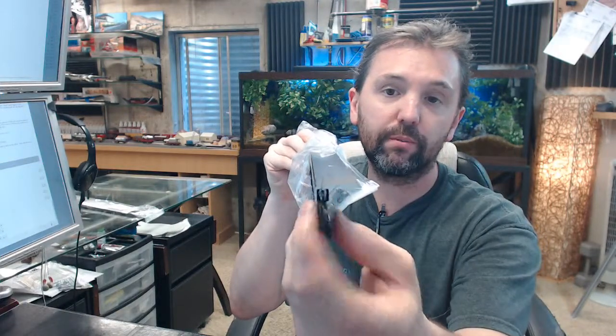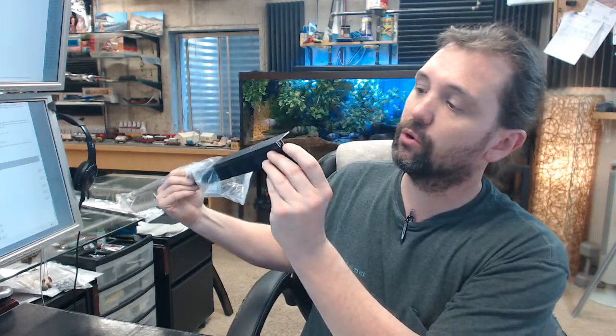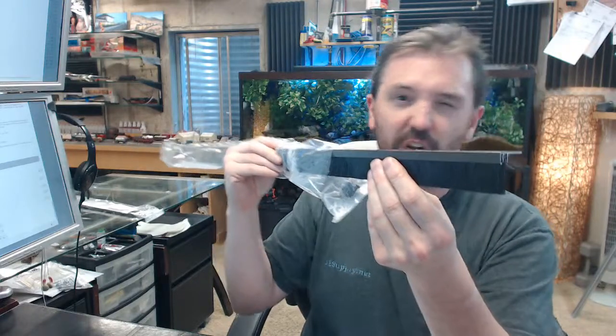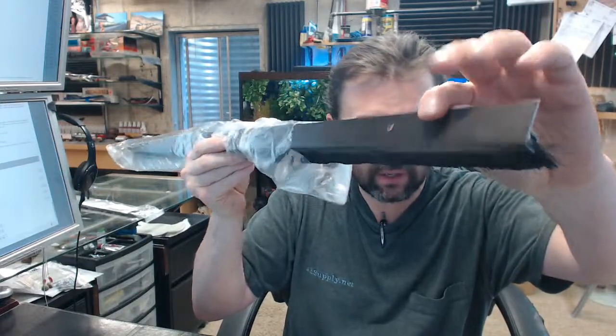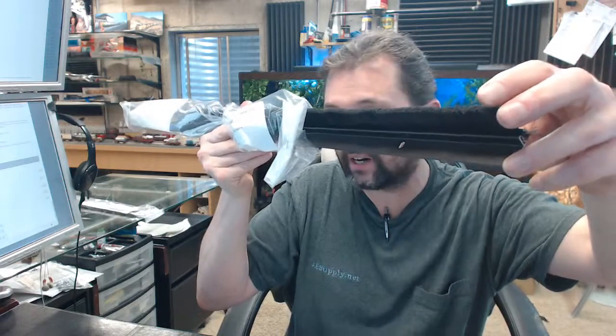The 984D is representative of this profile. It is a 90-degree aluminum holder with an inserted nylon bristle, held on with a steel crimp — a steel retainer. The D stands for dark bronze. This finish is generally not widely seen, but it's available in the D finish, dark bronze anodized, and of course the C finish, which is the clear anodized aluminum.